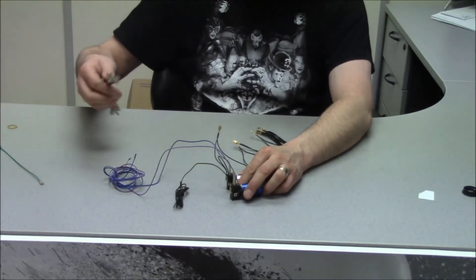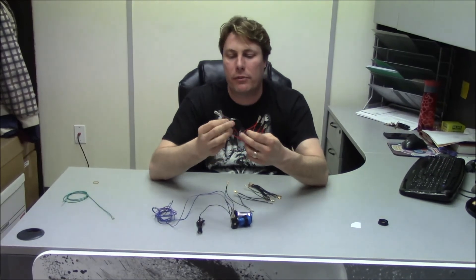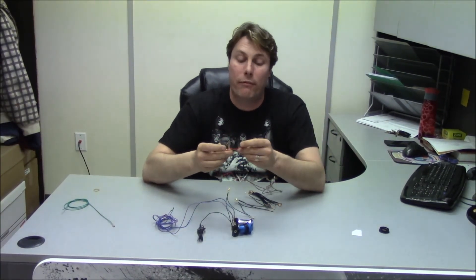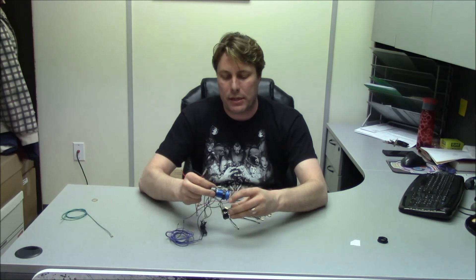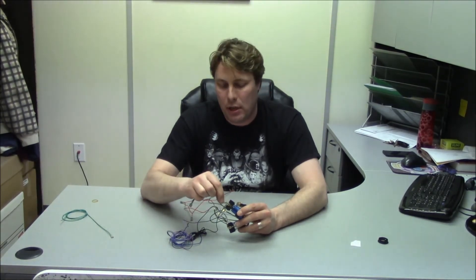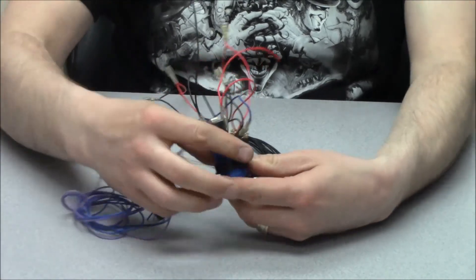This is the fun part that makes it a little more complicated. I do all the micro switch wiring first before I start doing the LED wiring. These LED harnesses make life so much easier. If you want to crimp them yourself and have that experience of making the harness — you know, go ahead, enjoy. I'll never do it again since I've gone to these harnesses. Now, when I said to use the mounting side as your ground, it doesn't matter, but doing it that way I automatically know that's my ground side at any given time. I use the daisy chain for ground, and the other wire is positive — boom.